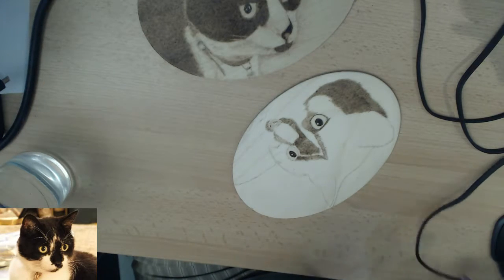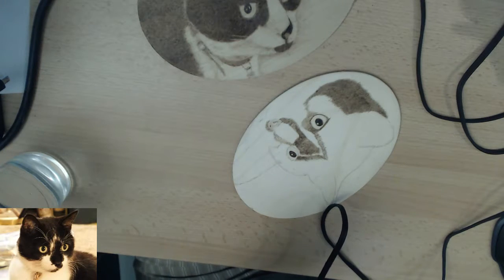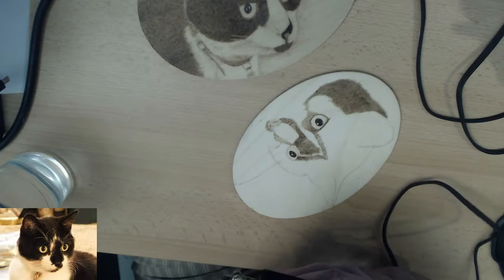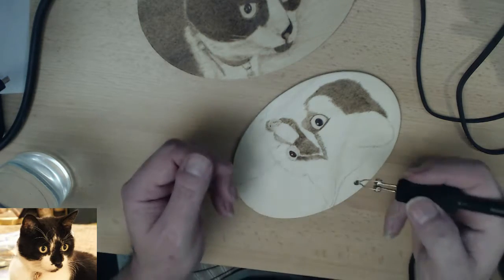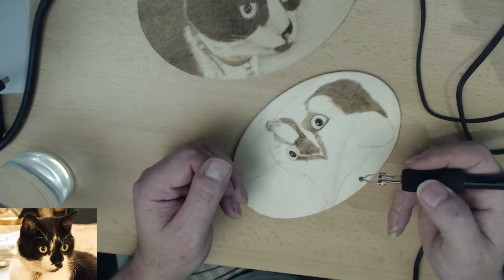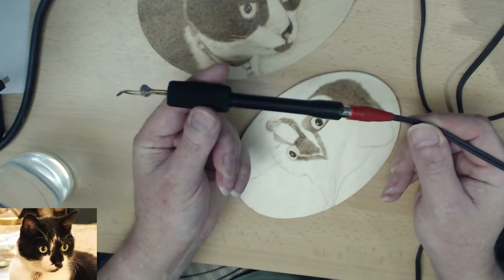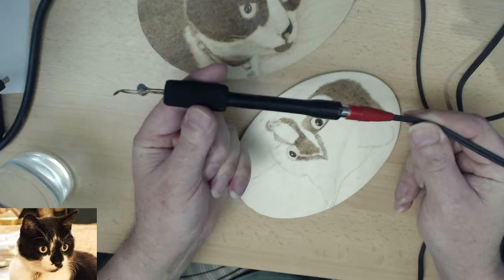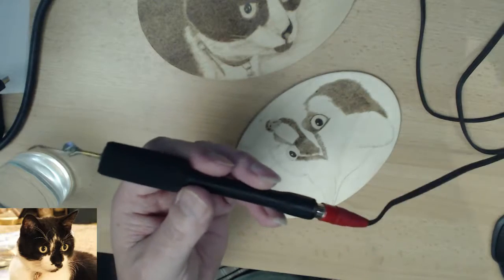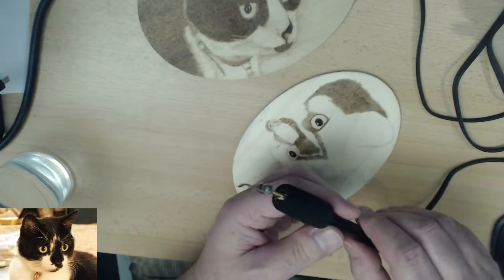Could be, might be. Okay, let me move that cable down there and see how that is. Not particularly... Well, I suppose I'm moving a little bit closer to the webcam, but that should not be picking anything up in the audible range. What it might be is, this is an AC-driven tool, not DC. So if you're hearing a buzzing, I'm suspecting it may be at 50 Hz, which is what this tool is running at. So all I can do is move things to one side.